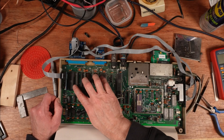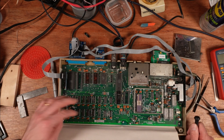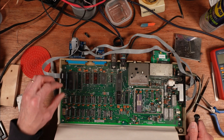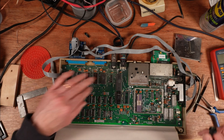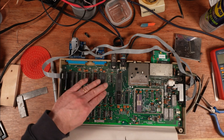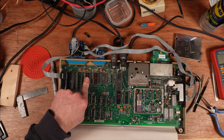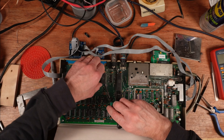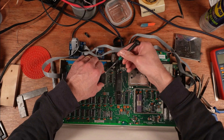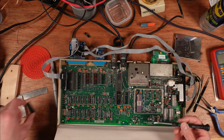With Dead Test it actually flashes an error code: 1, 2, 3, 4, 5, 6, 7, 8 — and it's consistent. Rather than starting to pull out memory chips — these aren't MT RAM, they should be fine — I wanted to eliminate the easy stuff first. So I started pulling out ROM chips. I pulled this one out — okay. This one — okay. Then I pulled out this one, and I'll be sending that one to you, Matt, because I think you'll be interested in it.